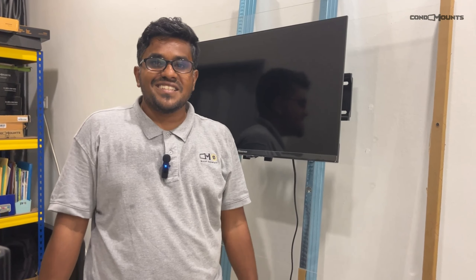This part is already attached. Now there are safety screws behind the TV mount — you need to tighten them. Use a long screwdriver for this, reach out for the screw, and tighten it so it goes up. Do the same for the other side. Tighten the screw so it is locked against the TV mount and you can't lift the TV mount up.